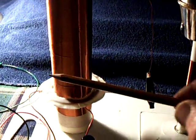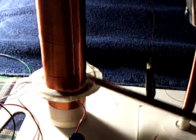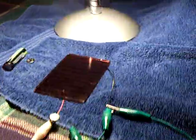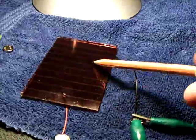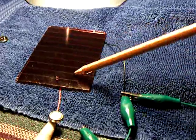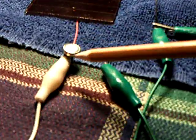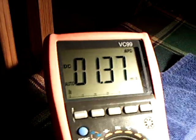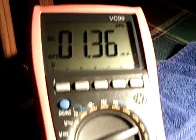I need to make a bigger coil here - this should be 3 inches in diameter instead of about 2.5, and then 16 inches long. But mine does work. I tried something tonight: I'm just running this off a little solar panel. It's about a 5.5 volt cell phone charger solar panel. And I'm going to show this running off a little button cell. You can see the standing voltage on this panel right now is 1.36 volts.